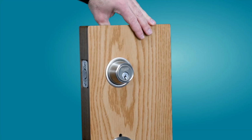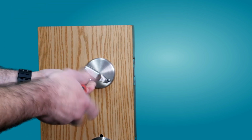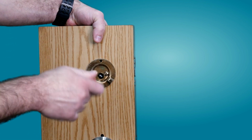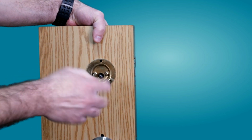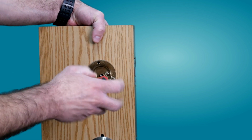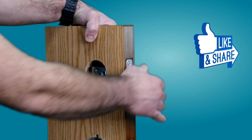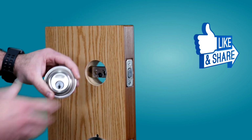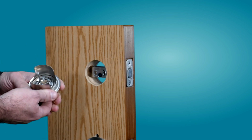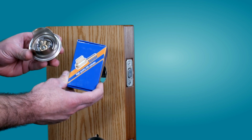Okay, so the first thing in the installation is removing our thumb turn. We're gonna remove the 2 securing screws for the deadbolt, and we're gonna use them later on with our back mounting plate for the WYZE lock. Alright, now as I told you before, my Schlage lock came with a standard Schlage keyway, and I'm gonna upgrade that with an actual Multi-Lock Junior kick cylinder.